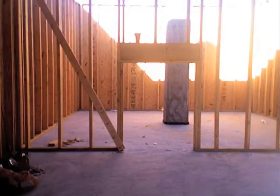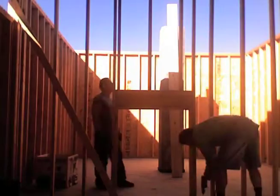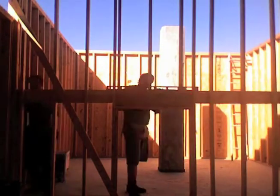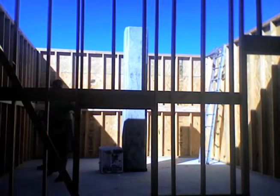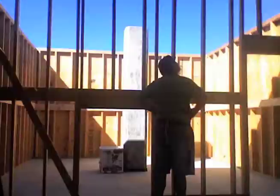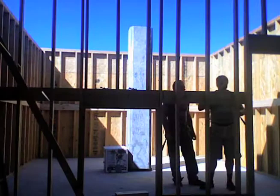During this weekend, my friend Skip Flower came up to help me build the observatory floor. This was a lot more work than I expected. We started by placing 2x8 ledgers around the outside of the observatory walls — this was the main support for the floor stringers. Then we put in the hurricane joist hangers on the east and west ledgers to hold up the floor joists.